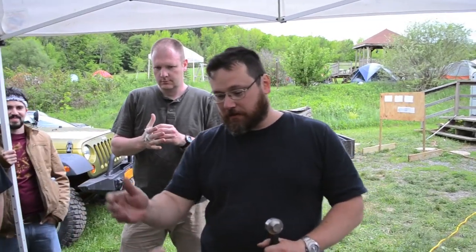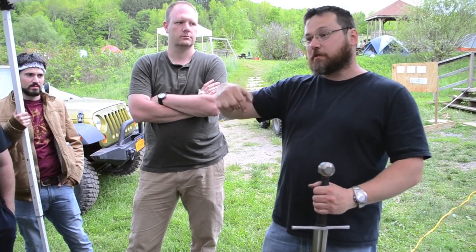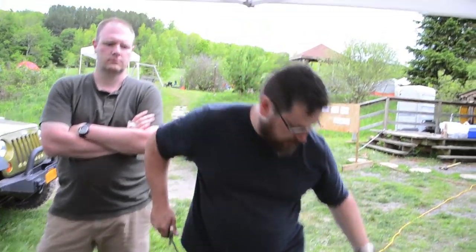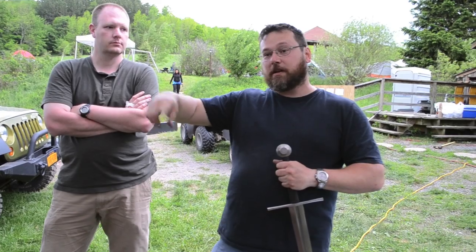Question: how much pressure are you applying to the belt? About this much — you don't want too much because then the belt will wrap around the edge and actually erase the edge you're working on. You put it on until you see the belt start to deform just a little bit. It's very light — just enough to make the belt deform a teeny bit. You've got to know you're touching it; if the pressure's too light the belt's not making contact. Touch it to the belt, the belt starts to move, you're done. Also check belt tightness — before I learned that I actually ruined a sword, put lines along the side of the blade. Although I later won that same sword in a cutting tournament.